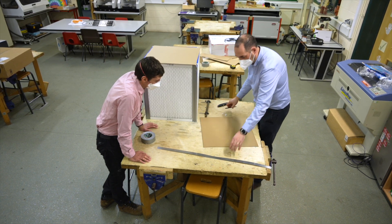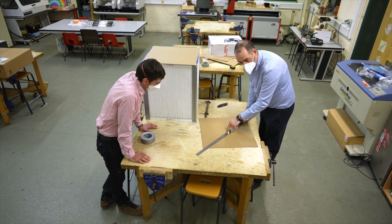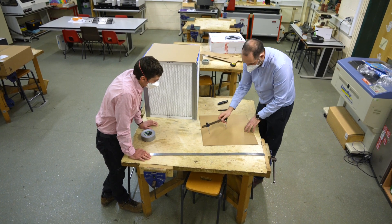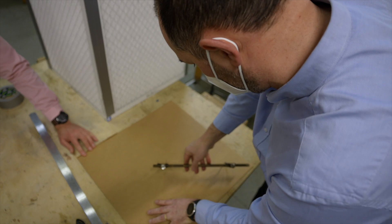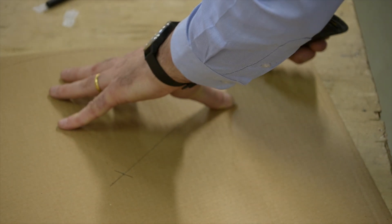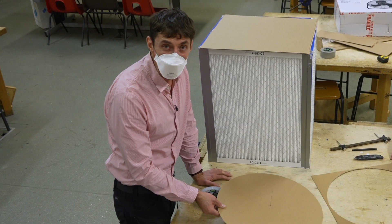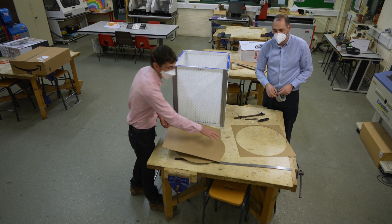The next stage is to cut a hole to take the fan at the top of the box. I'll do this by marking out the center, as I've done already here. I'm lucky enough to have a trammel to mark the circle, but you could easily do this with two pencils and a piece of string, or tape them to a ruler. Then carefully cut out the circle. We usually find that if it's an 18-inch fan, the diameter of the circle would be about 20 inches — just to give you an idea of the size of the cutout you'll need.